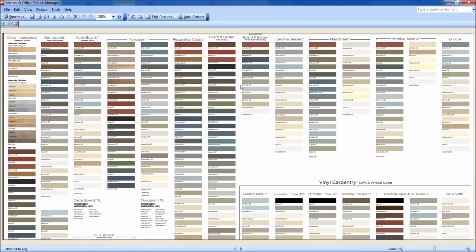This apparently is the various colors available from CertainTeed, the manufacturer, for the vinyl siding. And the one that we're looking at is this board and batten, more or less. Of those, they have these cedar boards, your 12-inch board and batten. But it looks like what you have on your garage, those ribs are spaced at 8 inches on center. And there will be a whole discussion, I suppose, on whether that garage is sided with this to unify both of these structures.